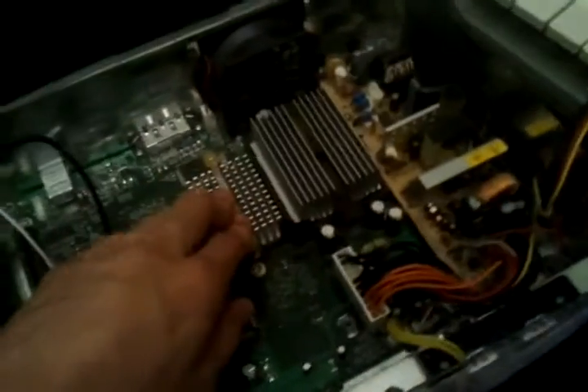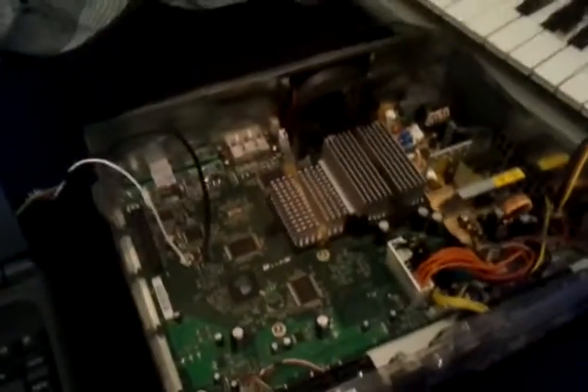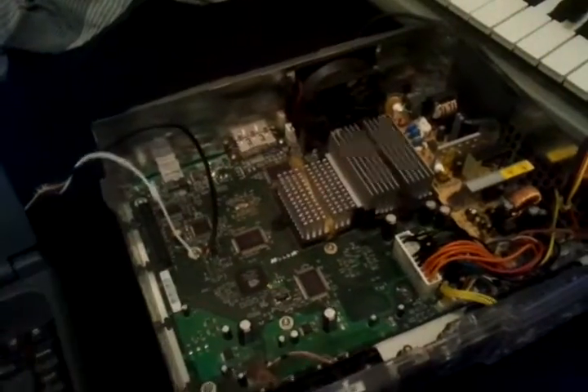The point of the video is reading the chip. There are two ways to actually get the hard drives to work. One is to basically do a hot swap, which is to turn on the Xbox with the hard drive attached, unattach the hard drive once it gets to the menu, plug it into your PC and then mod it from there. That works about 80% of the time.